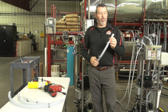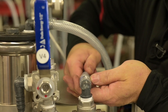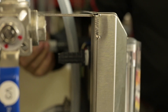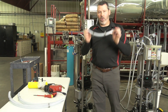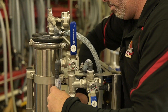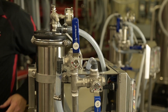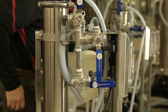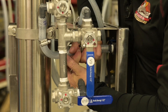In the kit you're going to have two half-inch hoses. One is going to be 17 inches — we're going to start with that one first. That is going to go to the V3 valve, and the V3 valve is going to go to the permeate, which is going to be your blue sticker. Now we're going to go with your 13-inch hose, which is going to go to your V4, to your concentrate, red sticker.